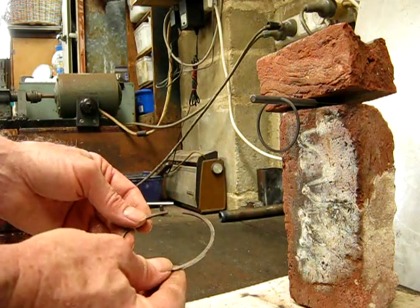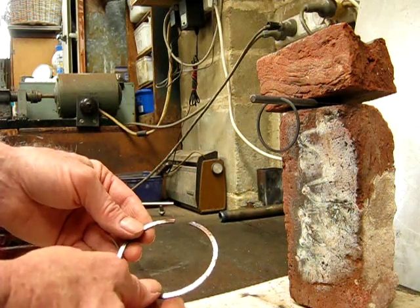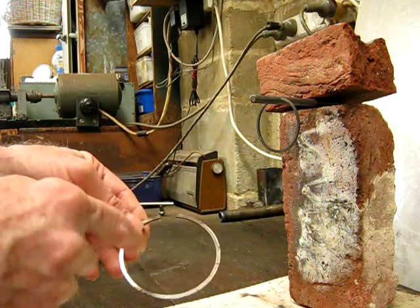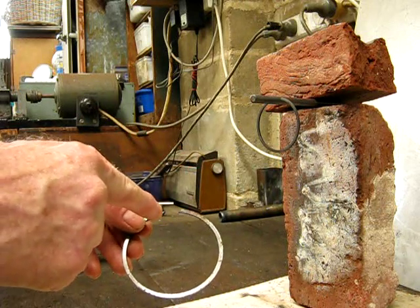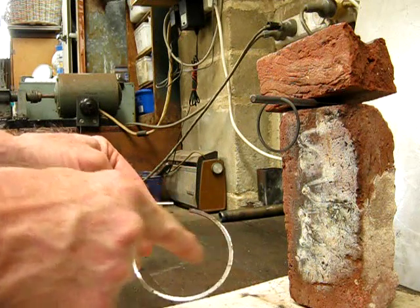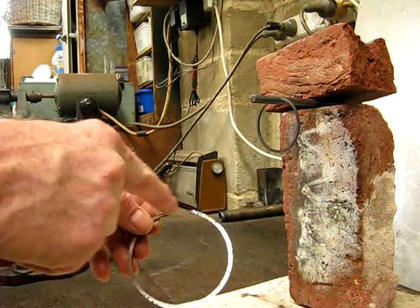Well it's quite simple really. There are a lot of complicated ways on the internet of doing it, but there's also a simple way. This is the simple way. All you do is you work out your amount of set, which is basically - get the diameter of the ring - 15% of the diameter is that distance there. It's as simple as that.